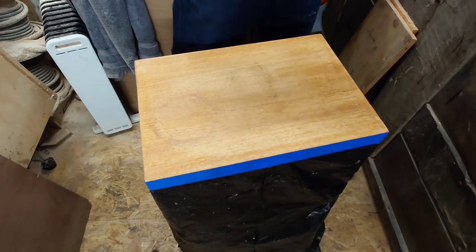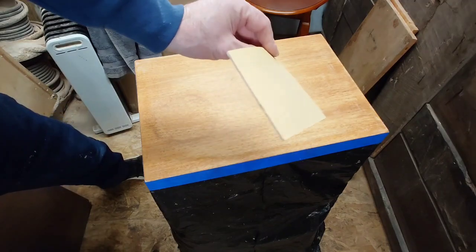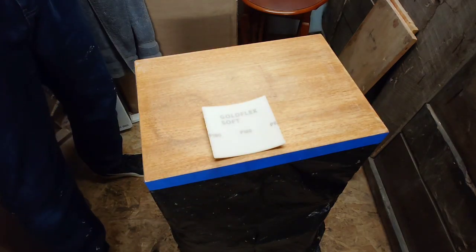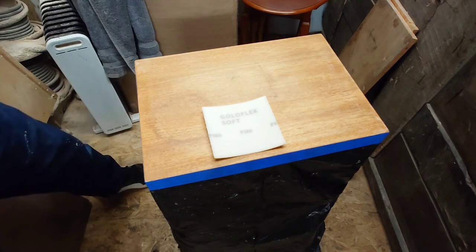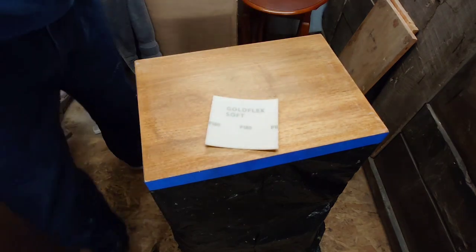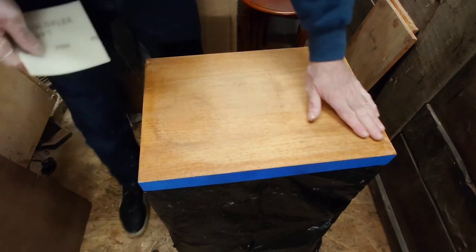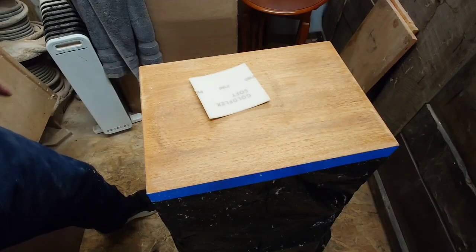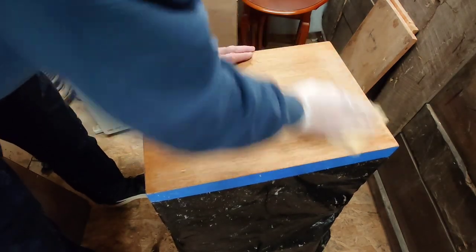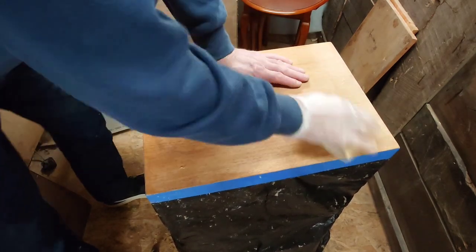I'm going to do it by hand. What we need is some sandpaper — this is the stuff I use, which is really really good; it has a foam backing so it can fold over, allowing very intricate work. I have two grades: 180 and 240. I'll start off rubbing with the 180. I'm doing this by hand because it's on video and it's going to make a load of dust, so it's easier to rub by hand. I tend to go across the grain a bit to start with, especially on the ends.